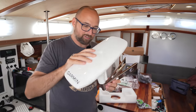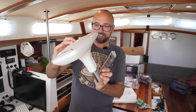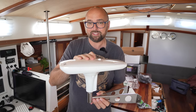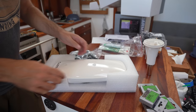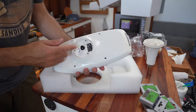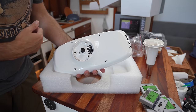This is roughly what the contraption I'm hoping to rivet to the mast is gonna look like. It's gonna sit above our radar so that the radar doesn't shade the MSC10, and also so that the MSC10 is protected by the radar if the staysail comes a-flopping. In terms of connections to get the MSC10 to work, life couldn't be much easier. It works off of NMEA 2000 and is also powered off of NMEA 2000.